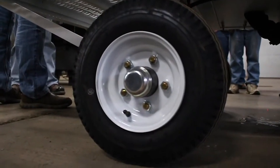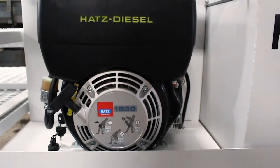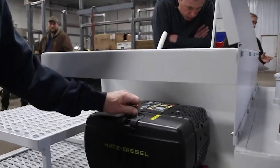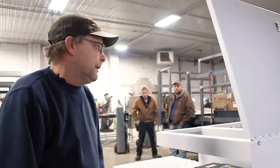You'll see that eventually the wheel bearings will go out — we sell quite a few of those parts. The hand pump over time if it's not used, and the pump itself after long periods of use. This has winterization so that in colder climates, anything around 32 degrees, you should plug it in at night if left outside. It has a sump heater which heats the water in the tank to keep it from freezing. It also has a heater in the compartment to keep the hose reel and all the water in the system from freezing, along with heat tape that runs from inside the compartment down underneath the unit to where the shutoff valve is. Your biggest thing is make sure that you keep the engine oil level checked, fuel in it, and it'll last for a long time.